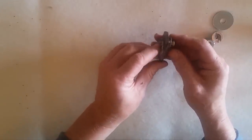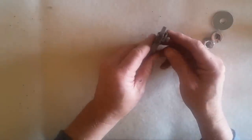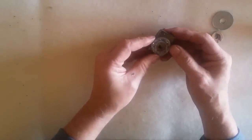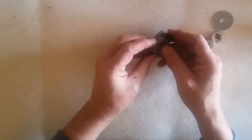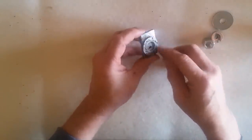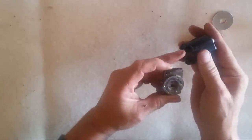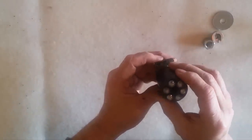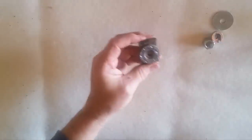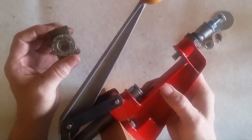This is just a proof of concept — I'm not real good at metal work anymore. What I've done is welded a shell holder that was an extra one onto a slug of metal, and then JB welded this washer on here, which is kind of a heavy half-inch washer. These rings of holes correspond with the safety pins on the cylinder, so it indexes so that you can go from one chamber to the next. What that allows you to do is use a C-press you might find at a garage sale or already have.